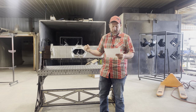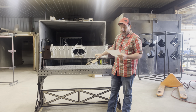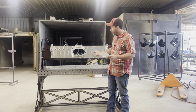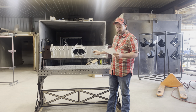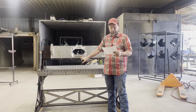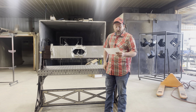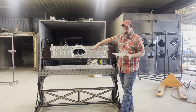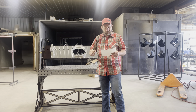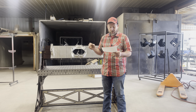Typically around a two-week delivery time. 12-inch by 44-inch billet machined Mic 6 fixture, one and a half inch thick aluminum plate. Pinion center location engraved on top for quick measuring references. Threaded holes for clamps — these are your threaded holes for clamps to lock in specific bracketry that you would need to build a rear end.